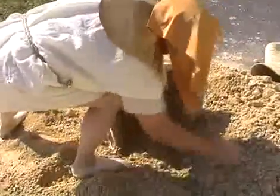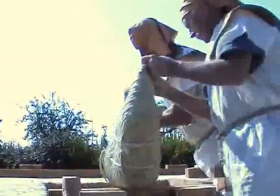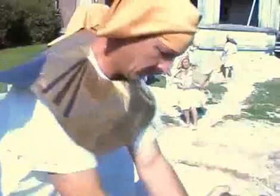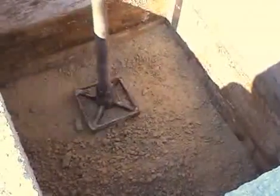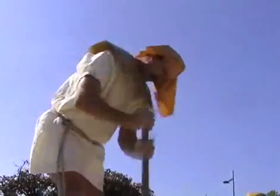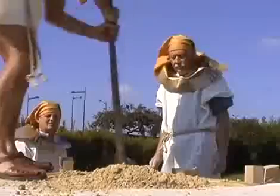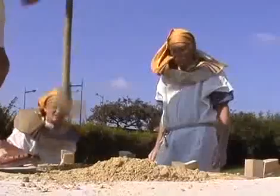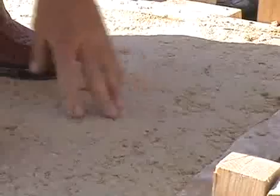We do all of the work manually, forming a human chain carrying buckets from the mixing area to the mold. We pour the limestone concrete mixture in a mold and pack it down with a tool called a rammer. Compacting the material requires little effort. The packing operation encourages cohesion and the denser mixture takes on high strength from the initial curing phase.